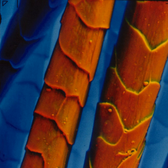An ESEM employs a scanned electron beam and electromagnetic lenses to focus and direct the beam on the specimen surface in an identical way as a conventional SEM. A very small focused electron spot is scanned in a raster form over a small specimen area. The beam electrons interact with the specimen surface layer and produce various signals that are collected with appropriate detectors. The output of these detectors modulates, via appropriate electronics, the screen of a monitor to form an image that corresponds to the small raster and information, pixel by pixel, emanating from the specimen surface.